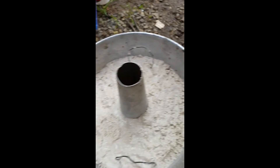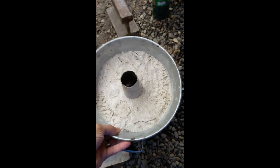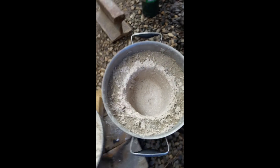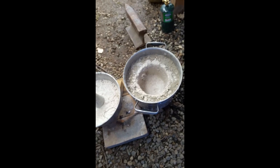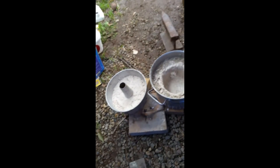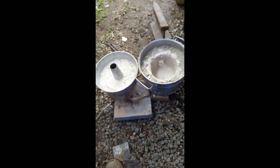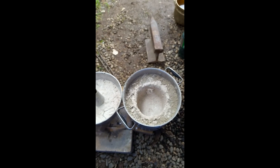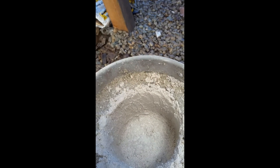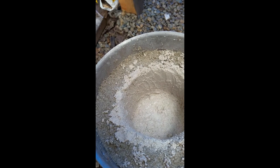Here's the lid right here. You can see that will fit right on top of there when it's dry, and it doesn't matter that it doesn't go all the way to the top. It should be a nice, very portable furnace — not too heavy. When it's wet, it's probably maybe 20 pounds with the lid included, maybe altogether 20. I put an almost straight refractory mixture around the inside and that's about a centimeter thick all the way around. That should basically make sure that the sand and bentonite doesn't get too hot.